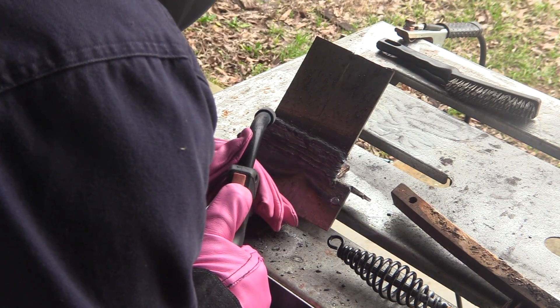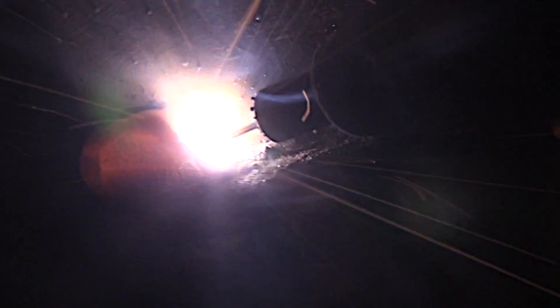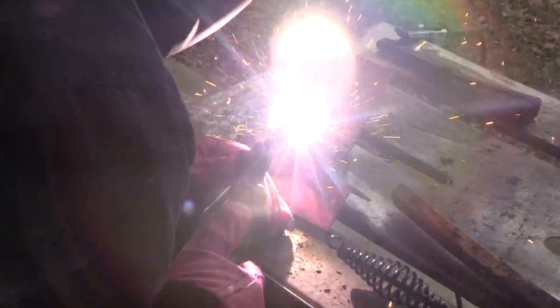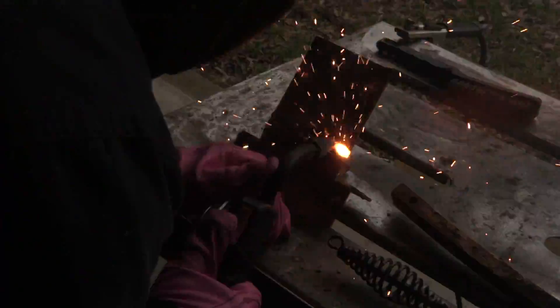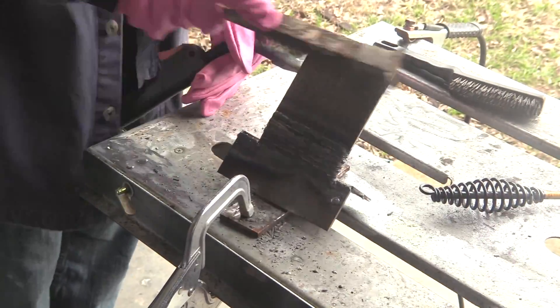Okay, it's Larry's turn here and I'll be looking over his shoulder, telling him to speed up or slow down or tighten up — things like that. I find that's very helpful in learning. If you can get a one-on-one situation with somebody giving you some guidance, it can really speed up the learning curve. Maybe the second best thing is to set up your own piece of metal just like this, watch a bead, weld a bead, watch a bead, weld a bead. And of course, do it with intention — pay real close attention to your stick out, your gun angle, and your travel speed.